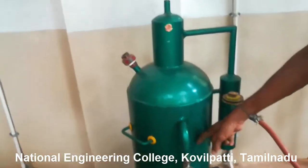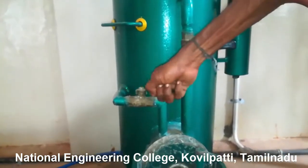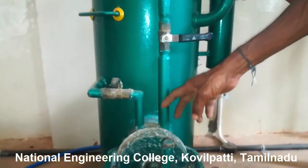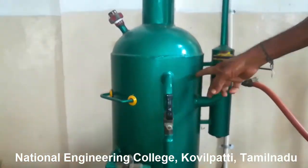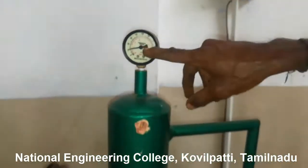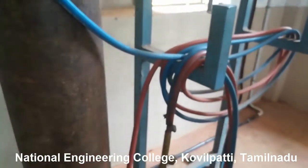This is the acetylene cylinder or acetylene generator which is used for producing acetylene. We place carbide stones in this tray. The line is for water — once you open the valve, the water is allowed to flow. The water reacts with the carbide stone to produce acetylene, which flows through the tube and is stored in the tank. Once you open the valve, the level of acetylene can be viewed in the pressure gauge. This pipe is the outlet, and once you open this valve the acetylene is allowed to flow inside the hose and we can use it for welding.